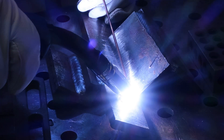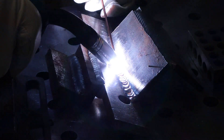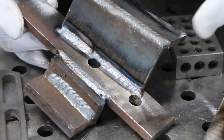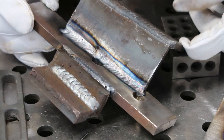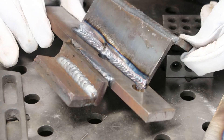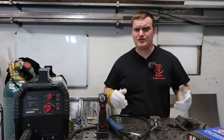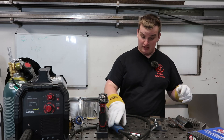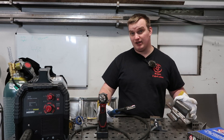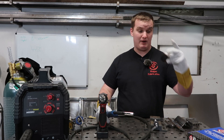So let's do this. It does technically work, and even with the machine on the lowest setting it seems like it burns pretty hot — at least with my machine turned all the way down; other machines might be different. But we just TIG welded with a MIG welder. I can't say I'm as pleased as I was hoping. It definitely works and can run a nice bead, but I did this on quarter inch and three-eighths, and that was about the right temperature — it runs a lot hotter. I did try it on some eighth inch material but had to run really fast.